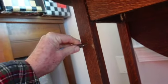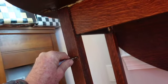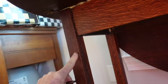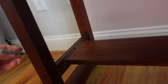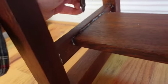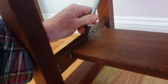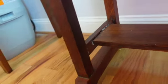And you don't have to undercut your glue so much either. And see, there's a piece right there. And just rub it in. See, what happens is people get something in there and it gets into the grain. And it's hard to get it out. So you just have to kind of stain over it. And this right here will go away. Cut that the other day, so that's a good example of it just going away.